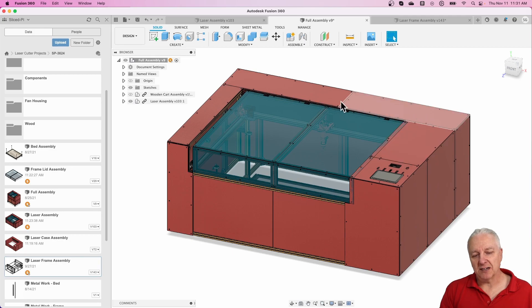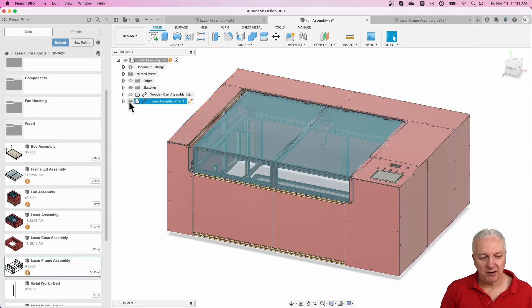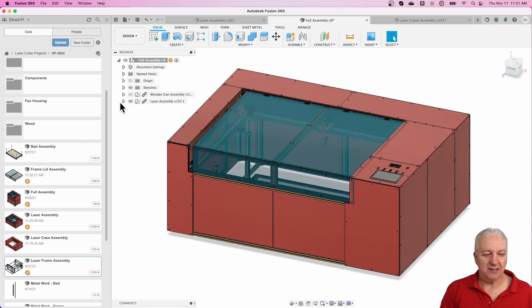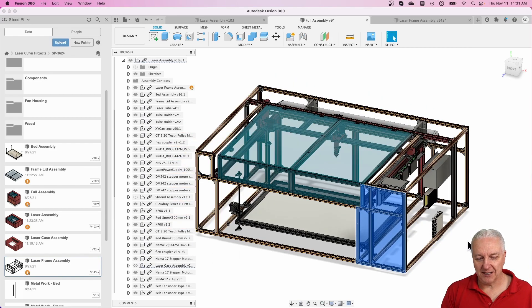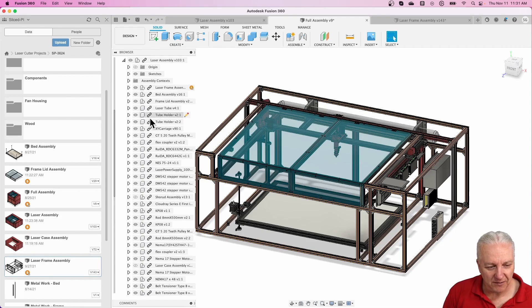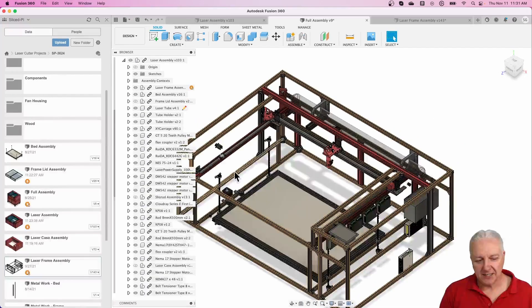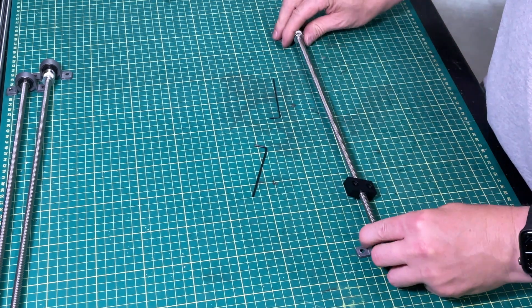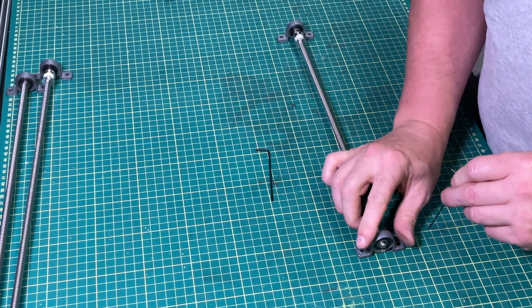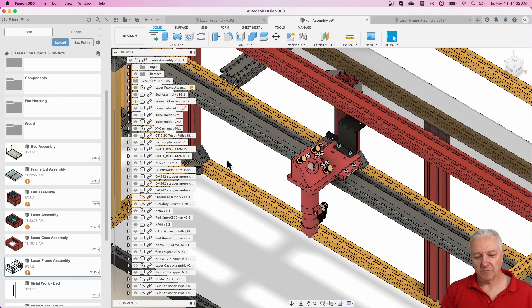I decided to use acrylic because I like how it looks. It turns out clear acrylic is substantially cheaper than colored acrylic, so I plan to use clear acrylic and paint the inside of it with Krylon paint. That will give me a nice clear finish on the outside as well as some protection from stray light. The acrylic itself is enough to protect you from any laser threat. If I turn off the skin and the lid, you can see inside the laser — there are four posts, which are the Z adjustments, some linear rails on the sides, and a linear rail across the middle that the laser output runs along.